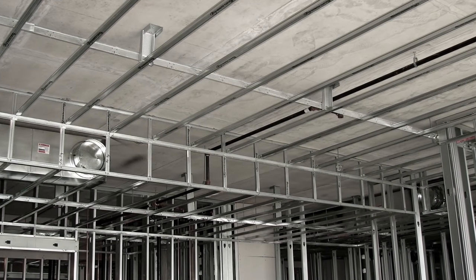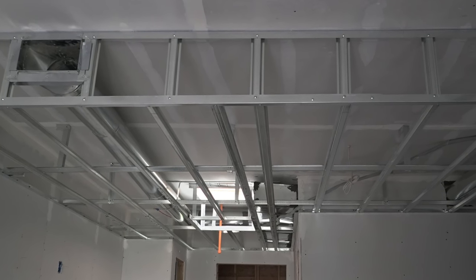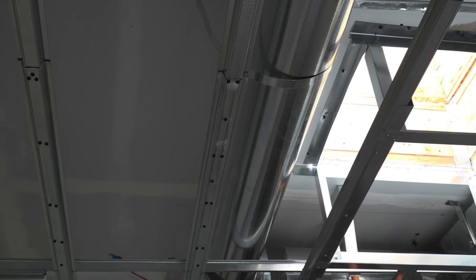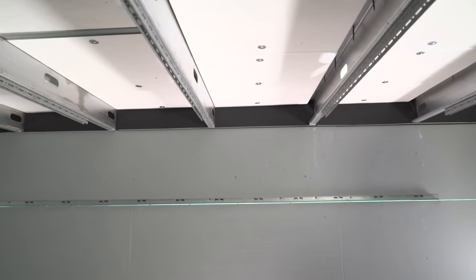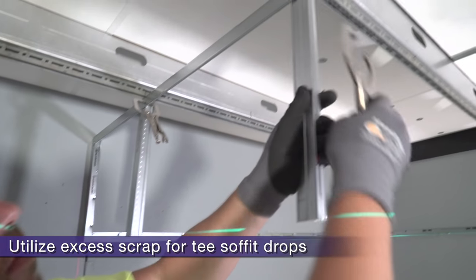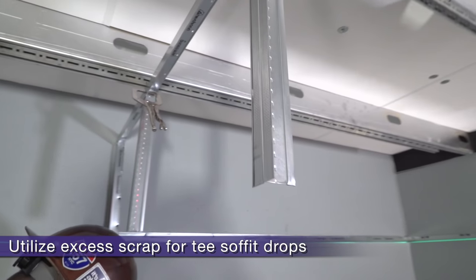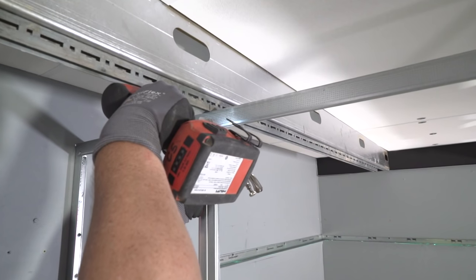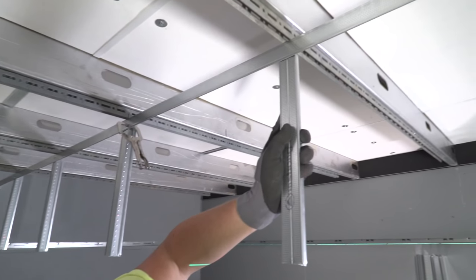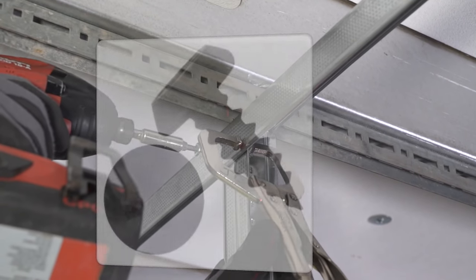Soffits — this is where you really experience Short Span's efficiencies. Notice these traditional black iron and hat channel soffits and how they need support to structure every four feet, not eight foot six like Short Span. Also notice how many screws are required to splice hat channel pieces together. Here we are going to come off the wall with a flat Short Span ceiling, then fur up with a soffit return to structure, commonly found in most hospitality and condo construction. CAM angle has been secured to structure while cut Short Span tee sections are screw attached to hang, and a laser ensures the T's drops are level and plumb.